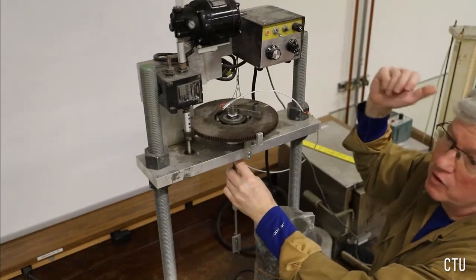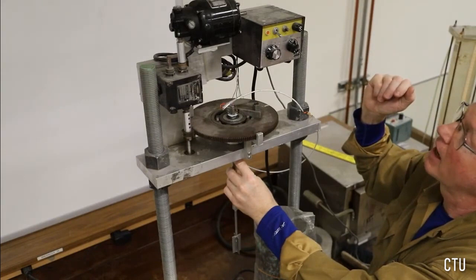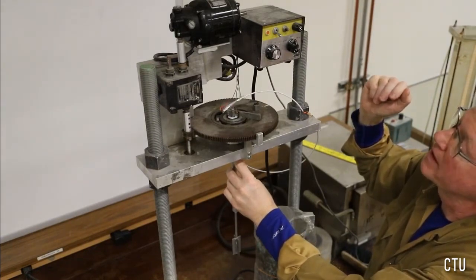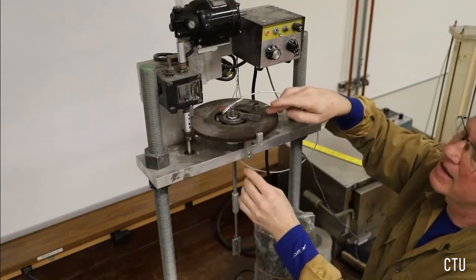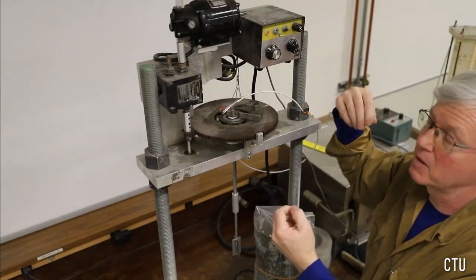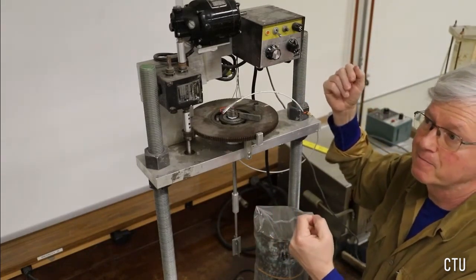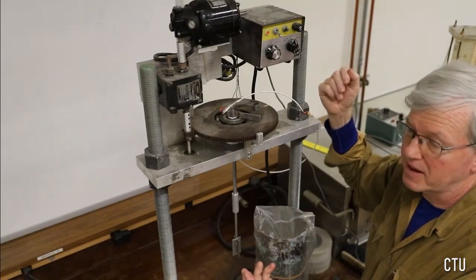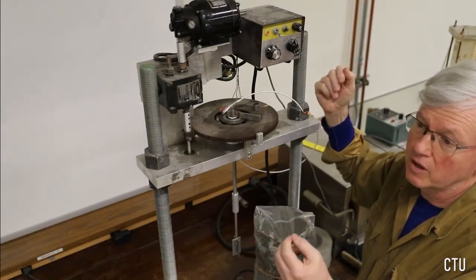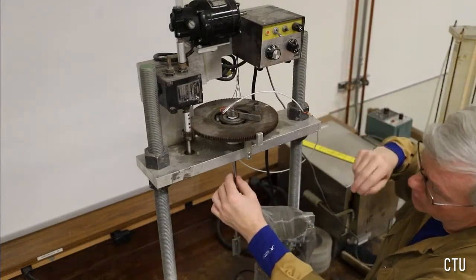So those load cell readings can then be recorded to a computer at high frequency. And if we calibrate the system by applying known moments to look at the voltage output from the bending load cell, we can calibrate the system that way. That way we can look at the data file and interpret any voltage as a known moment acting on the vane rods.